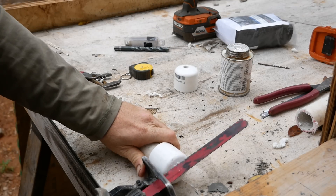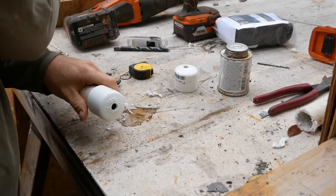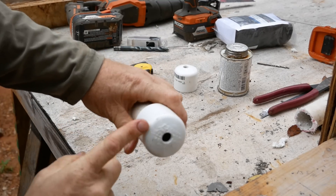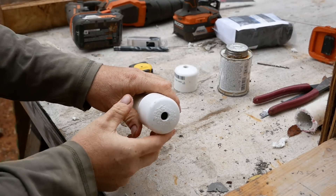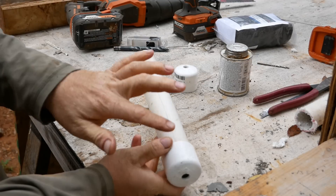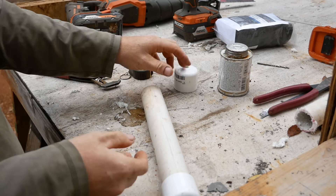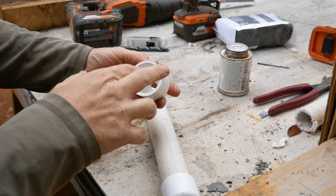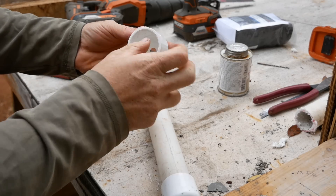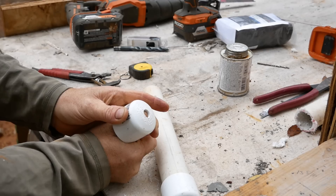Mark this end — don't cut through, just make a permanent mark on this end of your foam wand. It's important: as the foam and air pressure come through, the retainer rods hold the pads you're going to insert so they don't slip through. Otherwise, the pads will slip down into the cap and plug the hole, reducing or completely stopping your foam flow.